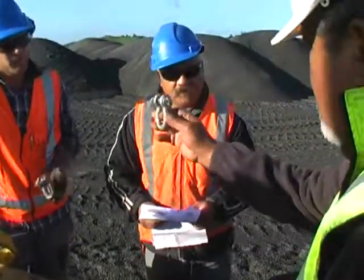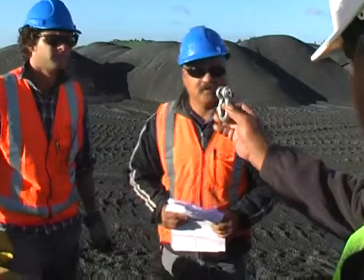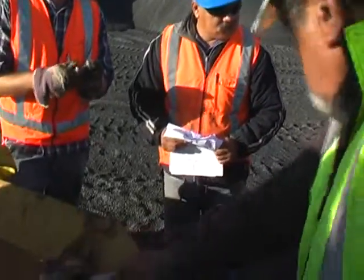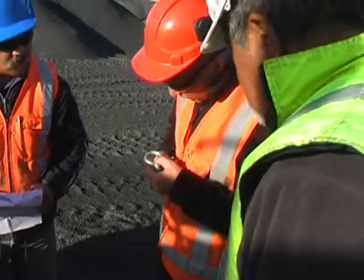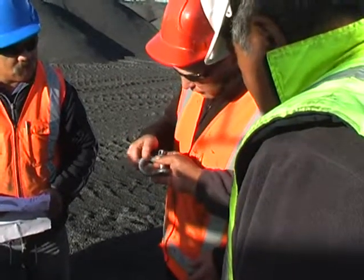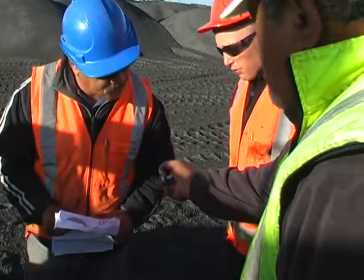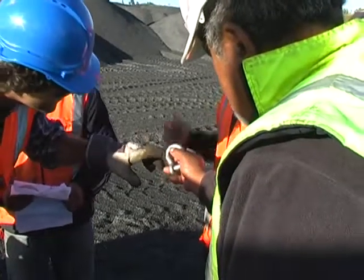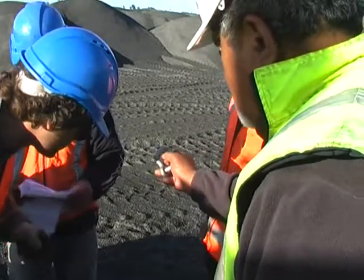The other thing you're looking at is when you're on that end there, it's straight. The eyelets are straight across from each other and the pin can actually go in and out easily. And the rating of that one? 2.6. There's your rating on that one there, look. Two ton. That's the rating stamped in it.